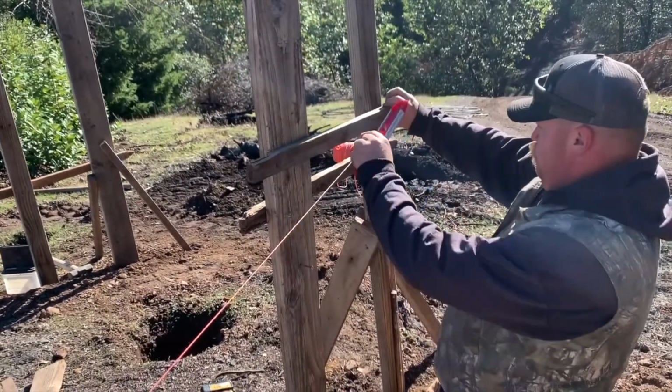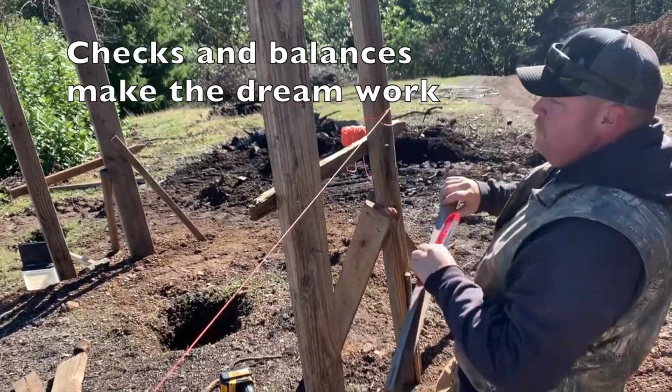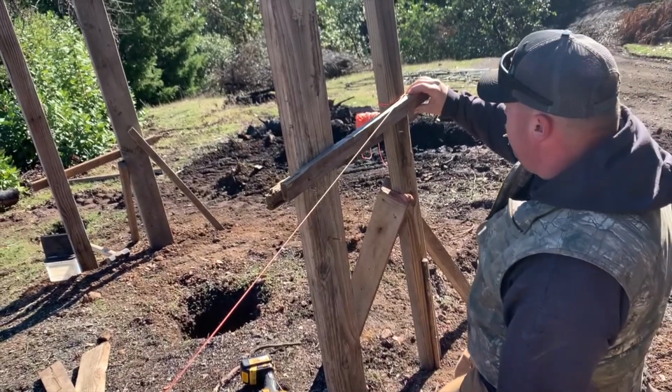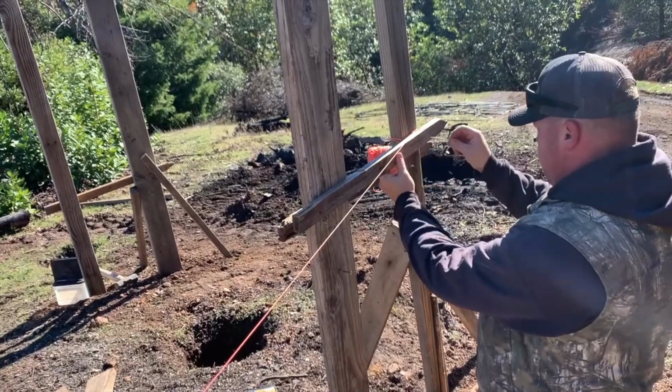And we know we have it at the proper elevation. We're not worried about measuring for underneath. No, bottom of pipe to bottom of pipe. So that's got to support. It's a good thing we have 2 people.